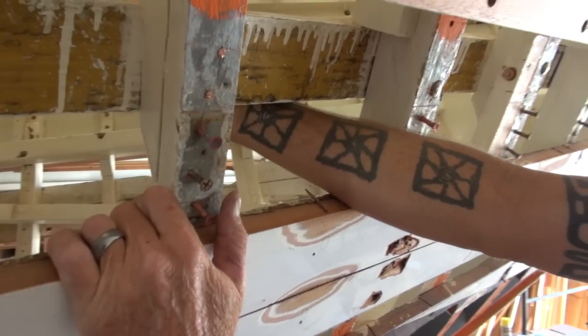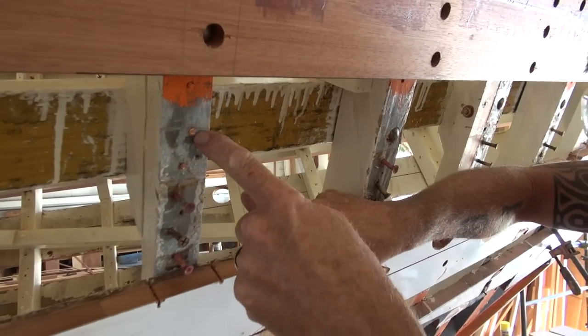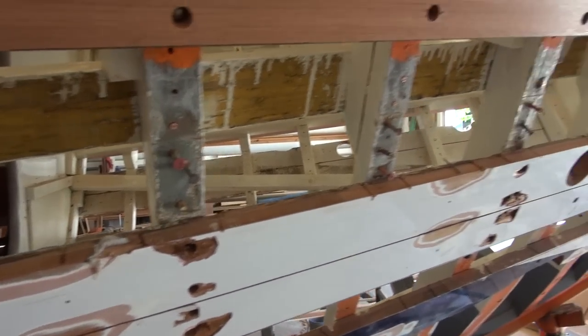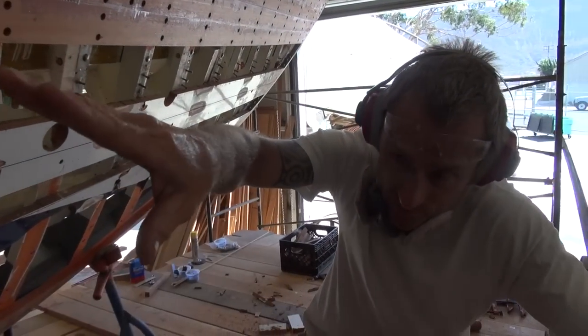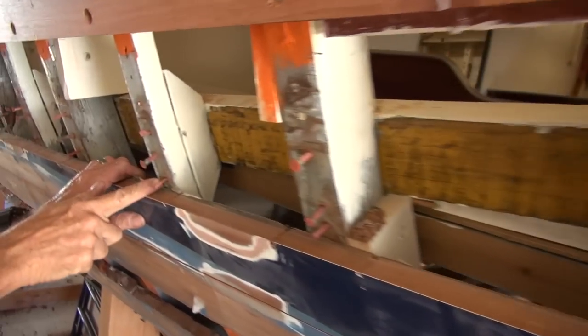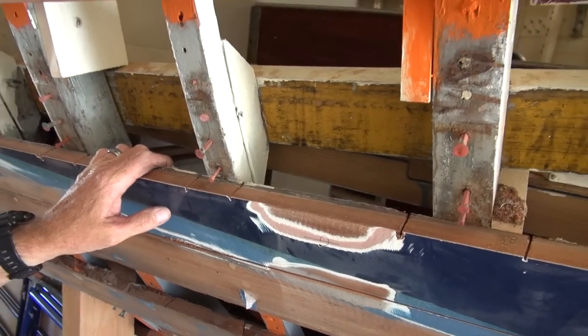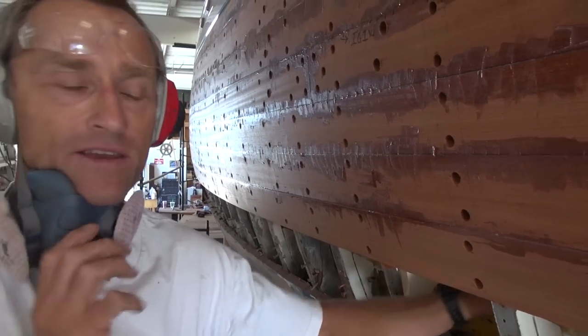I feel on the back here — I've already tapped it up. I'll pop it out, take it out, put the bolt in. I don't just take them all out — you don't want that longitudinal floating. This one is also at the water line, and a lot of these fasteners, as you get down close to the water line, see how thin that fastener is? That's after a lot of wear. Some of these I can't even punch — I'll have to go inside and grind the heads off and punch them back out. Where we can't get them out, we grind off and put a screw in.